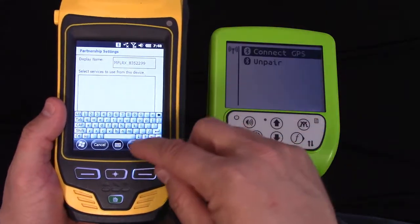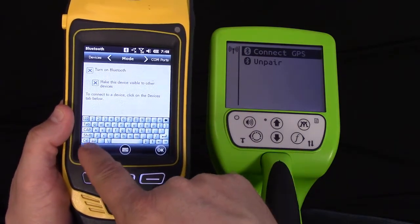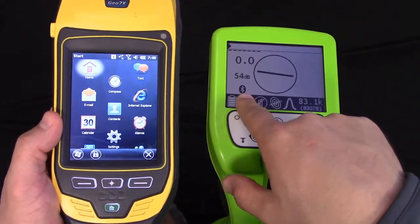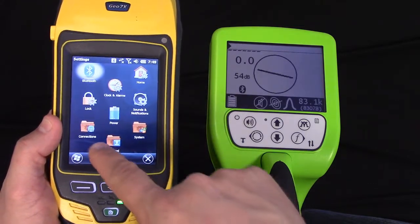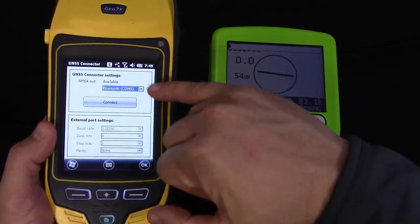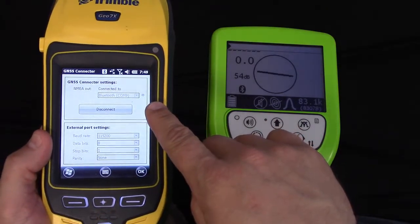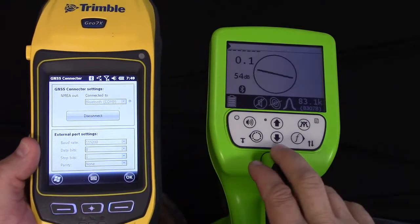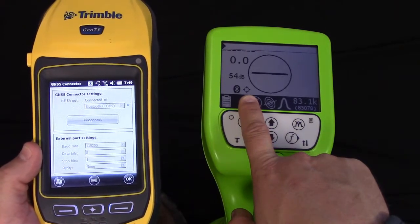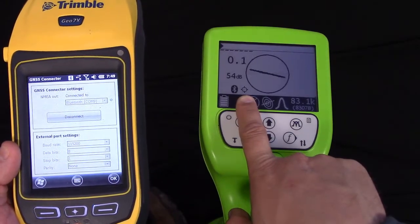We're going to select Advanced on the Geo 7 and we're going to save. Now we're going to go over to the Start menu again. On the receiver, we're going to hit the power button one time — we should see a Bluetooth icon. On the Geo, we'll go into Settings, then Connections, then GNSS Connector. Notice that there's a Bluetooth COM port here in blue; it's asking us to connect, so we're going to connect this. We've connected. You should see a blue light blinking, and on the locator you're going to get a target icon with a flashing circle. When that icon turns solid, you've got actual GNSS data. Right now we're inside the building, so we're not seeing that data, so this light will blink and eventually time out.